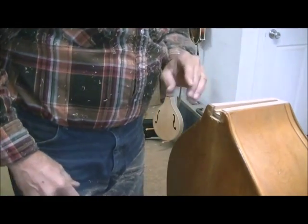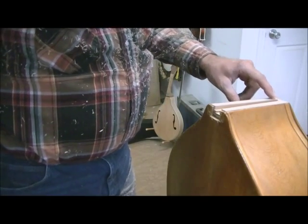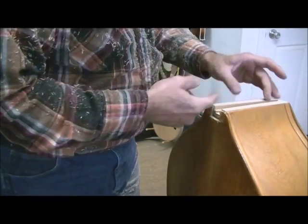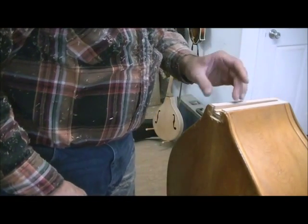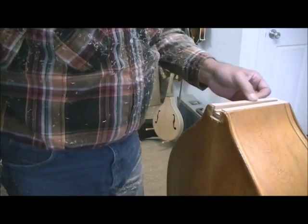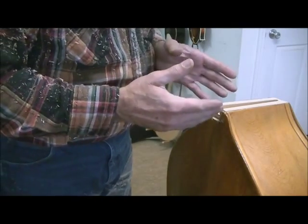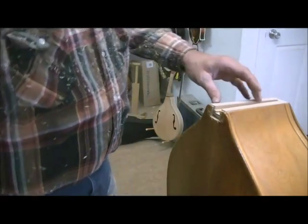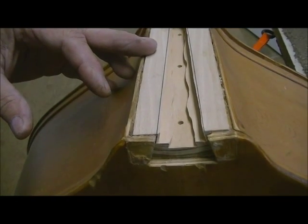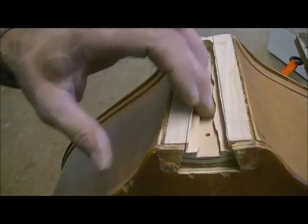I'm actually pretty impressed so far. I'm staying away from the far end — that'll be a flush cut anyway — because the dovetail cuts under, so I'm keeping at least a good quarter inch from that end so I don't cut through into the plywood. On the sides going down I'm staying about a sixteenth of an inch away. The lines are actually slightly narrower than I want anyway, so I've got plenty of wood there. It did a pretty good job.